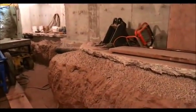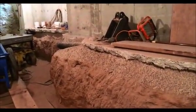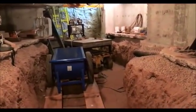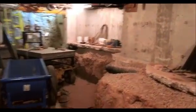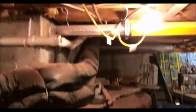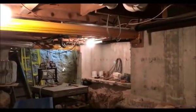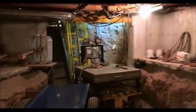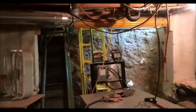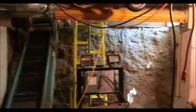I said earlier about the original soil staying underneath the wall, and that's not true in two areas. You already have the pathway through here — the hollow road. You can see it's just too narrow to leave the original soil there like a vertical wall in the cut. Almost the same thing on the other side. So there's shoring here holding those two walls apart so they can't go down into the wall. It's also the case where we cut the foundation wall — that's a non-load-bearing wall — and there's not enough of a return to hold that in place, so there's also a shore there.